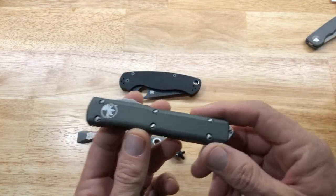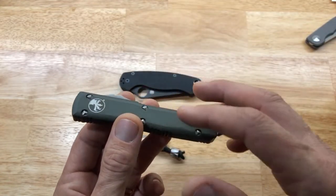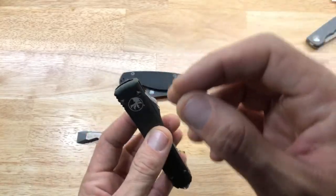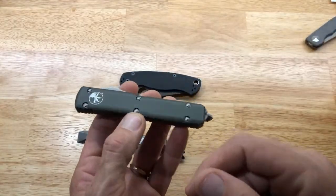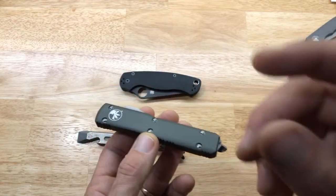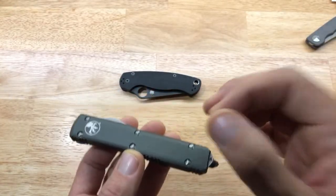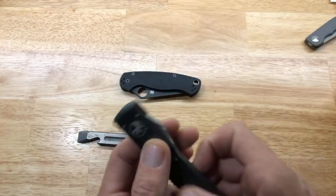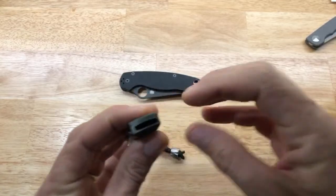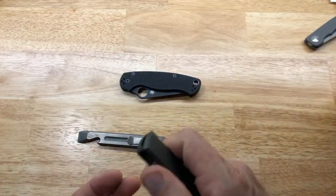So yeah, it seems like there's an oil that it really likes. Again, I'm a finish carpenter, so I have pneumatic tools. That pneumatic tool oil I use, I think it's a Bosch actually, it's a really thin, dyed red oil, and it loves that. At work, I'm like, oh, this thing's not firing, and I will just put one drop down this side, one drop down that side. Seems to do the trick.